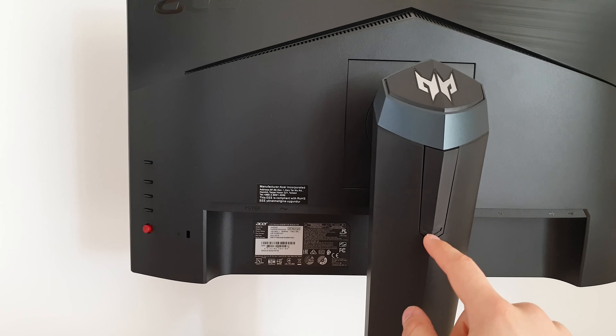Either way it's pretty typical for a TN model — it doesn't have amazing contrast, it doesn't have an inky look to darker shades, and it doesn't have the atmospheric look a VA model with decent contrast would provide. However, as a TN panel rather than IPS, you don't have IPS glow to contend with, so things don't look flooded towards the corners. But the image does look deeper towards the top of the screen, with things appearing more blended together, whereas further down the screen there's excessive detail in dark areas and a slightly banded appearance.